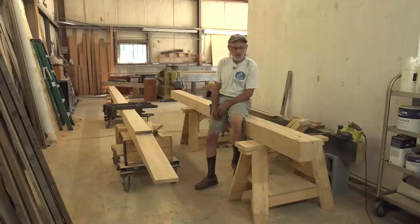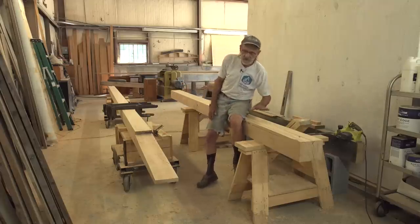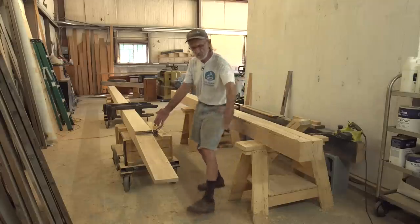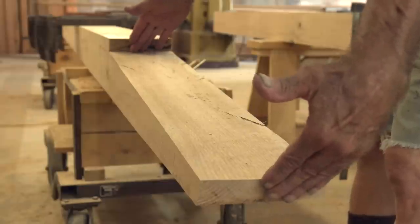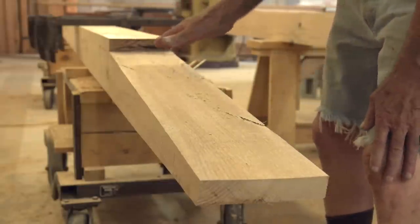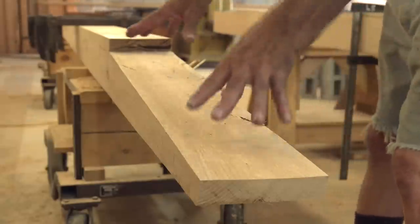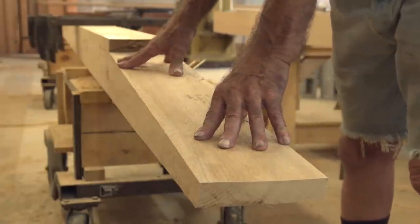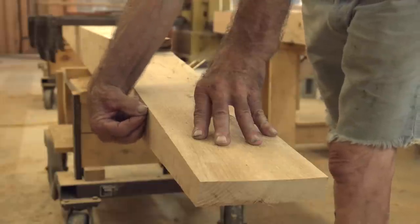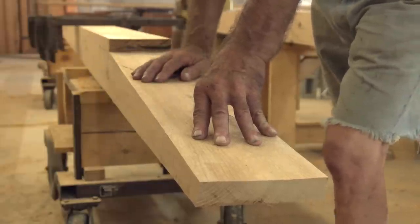Now I'm scarfing two pieces together. This is the forward part of the keel, and this is going to be the after section of the keel. They're spliced together with a nice long splice here - it's three feet long. The ends are an inch and a quarter on each side, and it's undercut so that the ends don't pop up. I've cut it a little differently than most people would, so that I wouldn't cut past the line or cut the line away - because if I did that, I wouldn't know exactly where I'm at.